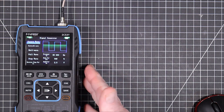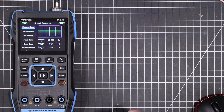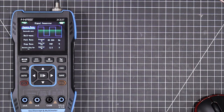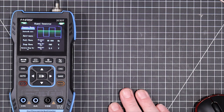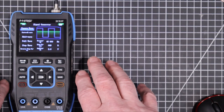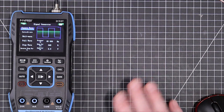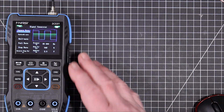I didn't think I would ever like this form factor, but now that I've had a chance to play around with it, it's not that bad at all. It'd be very handy for sticking into a tool bag, especially in the case that's supplied with it — a really nice portable instrument. For somebody working with Arduinos and stuff like that, this would be a perfect little instrument. The scope is definitely good enough for that — it's got dual channels and is really good up to about 40 megahertz. In the Arduino world where you're dealing with a maximum of 16 or 20 megahertz, this thing would be perfect. It's got a really nice multimeter — accurate, four-and-a-half digits, automatic mode works, auto-ranging works very quickly, and it has all the basic functions. It's very nice that it has these three functions together. For the average hobbyist coming into electronics, especially to work in the maker space, this thing is a fantastic tool.